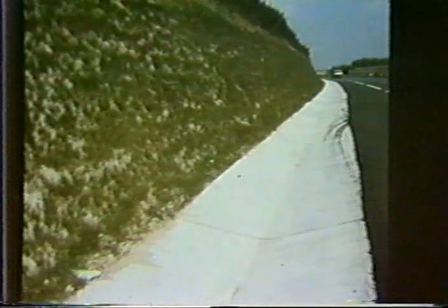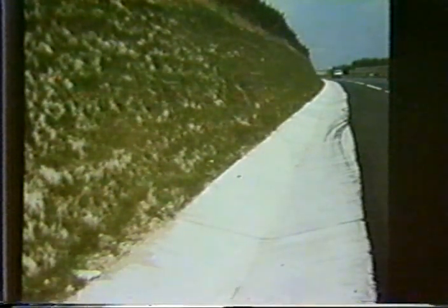And here's a close-up of what these fibers look like when you dig them out. I went up close and started digging. I couldn't dig any further than the length of my fingers because there was so much fiber in there. And of course, this in combination with the roots of the grasses that are growing on the slope will reinforce the slope and protect it from further erosion. And here is a 60-degree slope, basically sand, reinforced with the fiber and now vegetated.